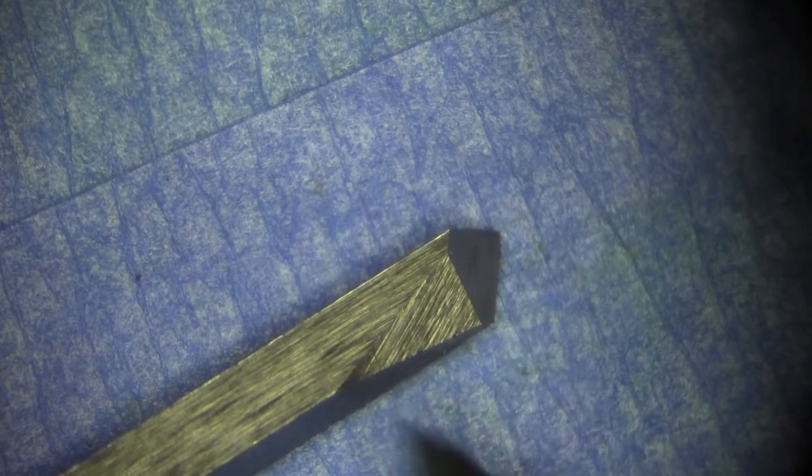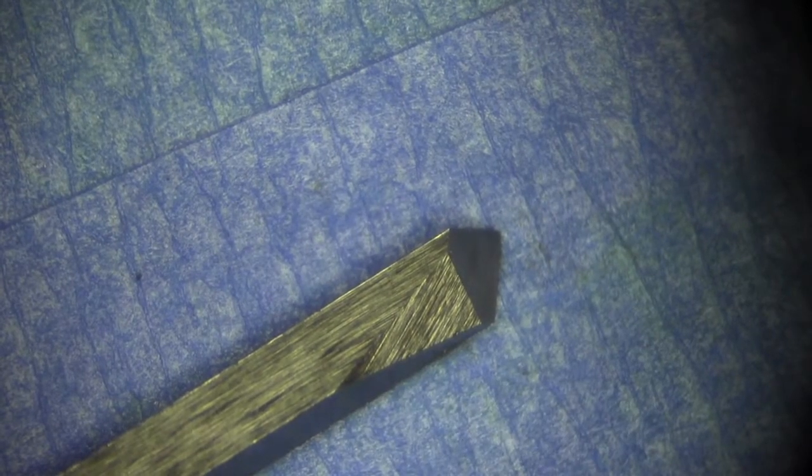This tapering of the graver doesn't necessarily add any functionality to the tool. This does, however, cut down on the amount of time that you will need to sharpen the face. We will not be tapering the tool in this video.